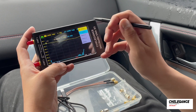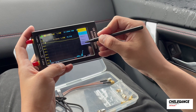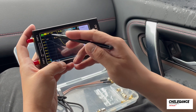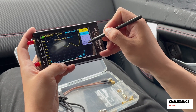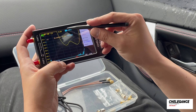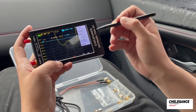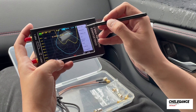We need two formats: one for SWR and the other for SmithChart. First we change the format of Trace 0 to SWR. Next, we'll switch to Trace 1 for setup. We'll adjust Trace 1 from the S21 parameter to the S11 parameter. Click on Channel to change it, then click on Format to change it to a SmithChart. At this point it's set up.